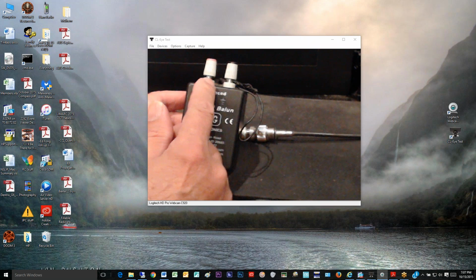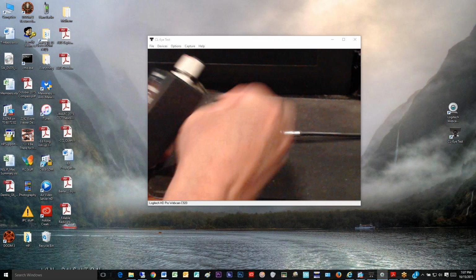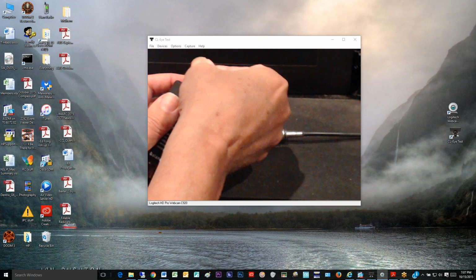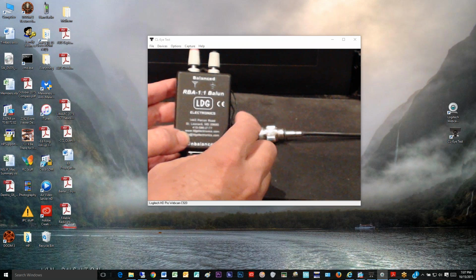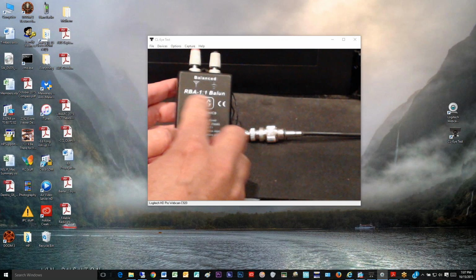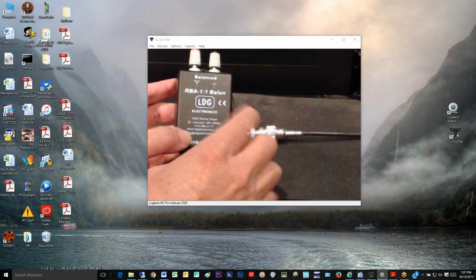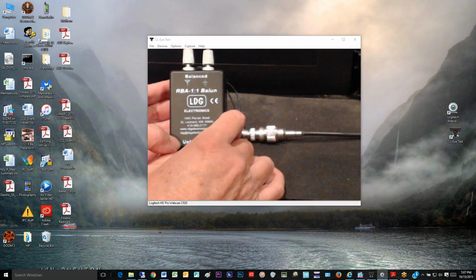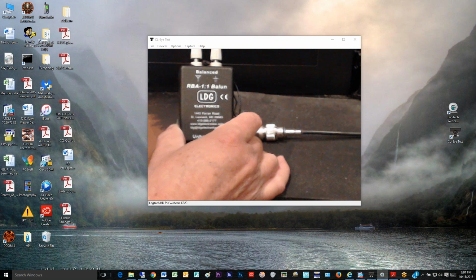And then up here, this is perfectly suited for a dipole. I just put in a piece of wire here, a piece of wire here, screw it down, and off you go. This happens to be a one-to-one balun. They make them 4-to-1, 5-to-1, 6-to-1, depending on how unbalanced your system is going to be. You'll learn a little bit more about that in a general class, but I just wanted you to know that they exist.